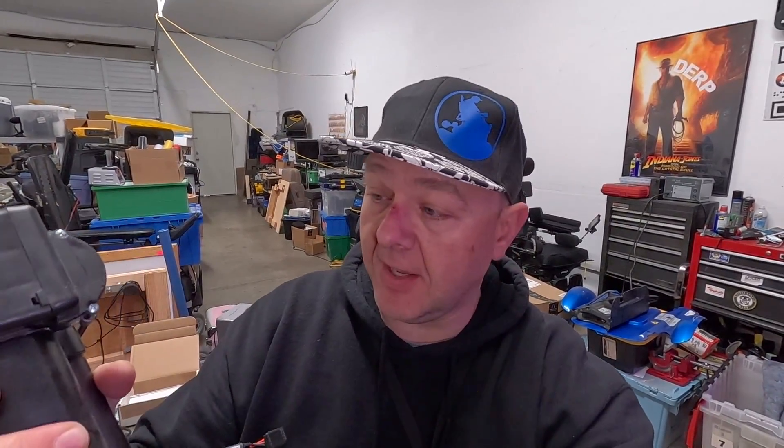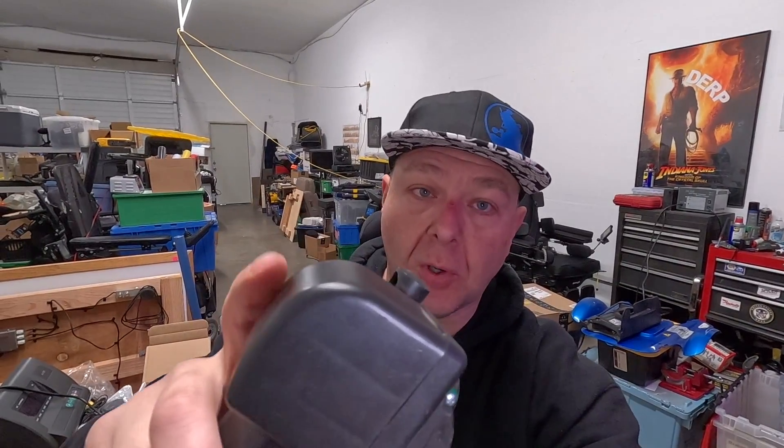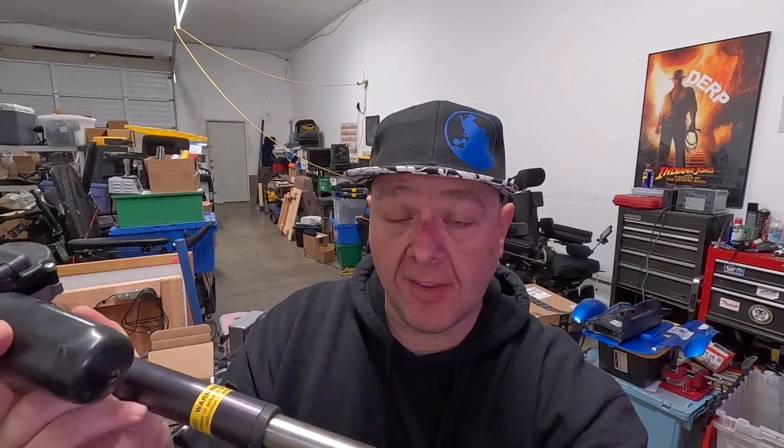Now the way the seating actuator system works on a Permobil seems like a bit of black magic, but it actually simplifies things quite a bit. I'm going to link the video up above and down below to Shop Class Episode One, and that will explain kind of why things are the way they are. Basically these actuators, whether they are smart or not, have positional awareness baked in. There's a little controller board inside here and some hall effect sensors, a set of gears, and some spinning magnets. What that does is it allows the logic board inside to store the position of where this actuator is in space.